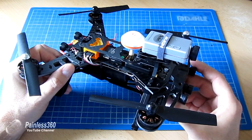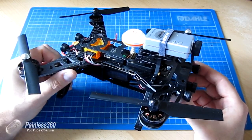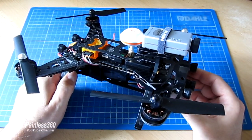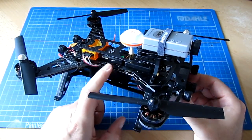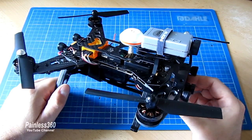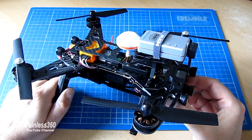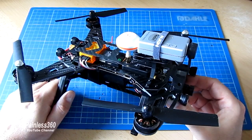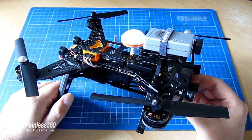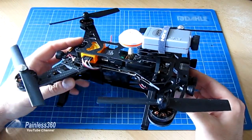Now I would exercise extreme caution when doing this. The challenge with MultiWii is that you should always use the graphical user interface that matches the same version as the MultiWii code on the board. The other thing to be careful of is that Walkera have not released any software for you to talk directly to the flight controller, so what we're doing isn't necessarily supported. Don't write anything back to the board unless you're having a problem, as this won't allow us to update firmware. Always make a note of how it is shipped before you start changing things so you can set it back.